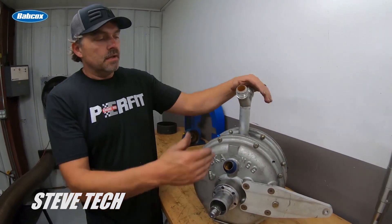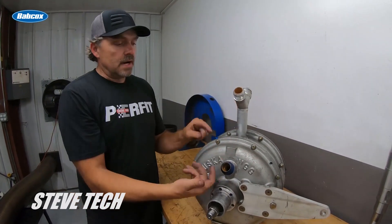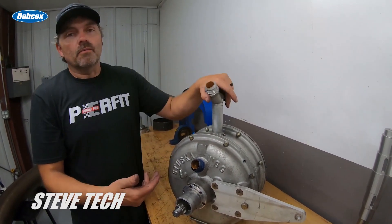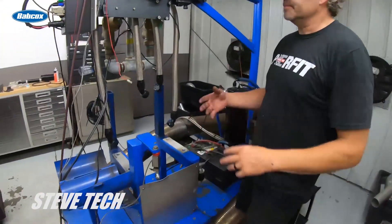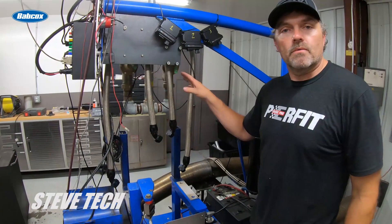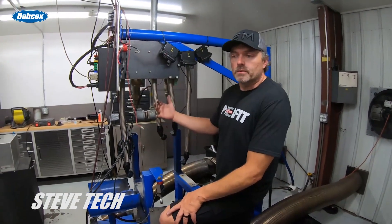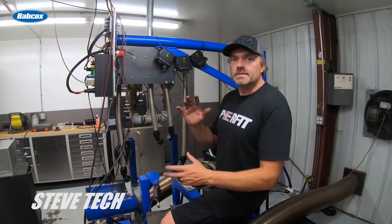That's why after I changed this vent - which used to just make it directional because there was no water on the inside of the rotor - there was nothing there, so you could put a vent there. That's why there's a vent there stock, and why this doesn't work any longer when I change the rotation direction. On the actual stand you can see water in on both sides - a lot more water compared to the other dyno over there. But the other dyno works great too. More water equals more load, if you can have it applied properly with the right venting and outlet size.